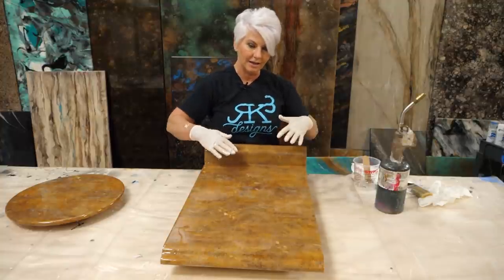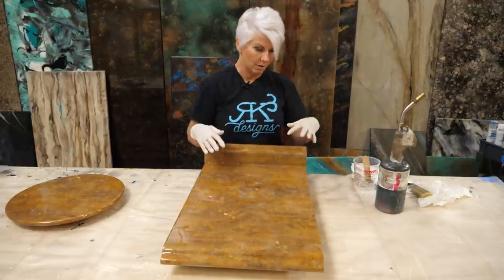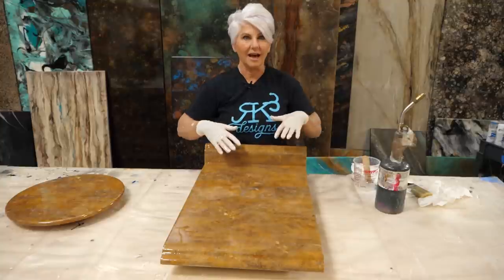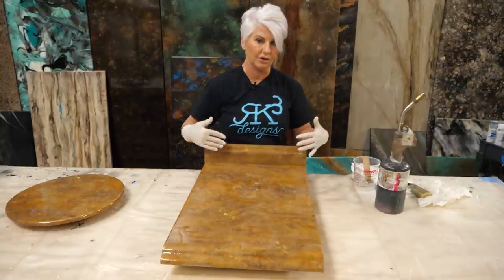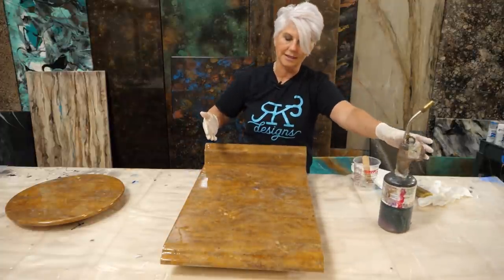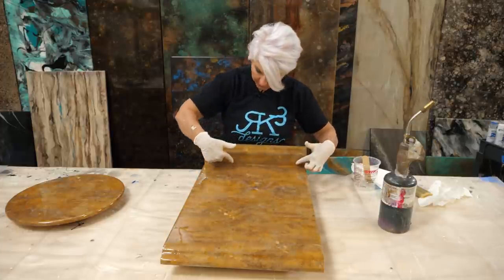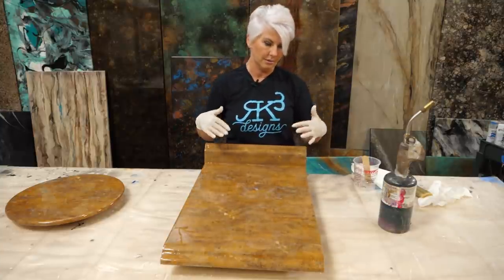now I'm gonna come back and apply another complete coat of epoxy. Now, my edge is actually gonna have 2 coats of epoxy here and on the front edge, so it's gonna be very, very durable. That way, you really ensure that you have an abundant amount of epoxy on your edges and your backsplash. All right, so I'm gonna torch this. And like I said, I'm gonna wait for probably 20 minutes or so. I'll come back, scoop up everything that's drained down here in this little edge, and put it back on my backsplash.